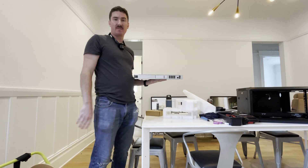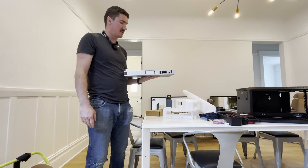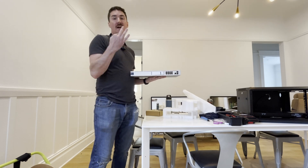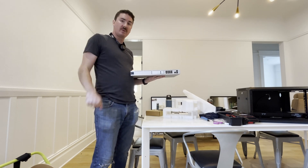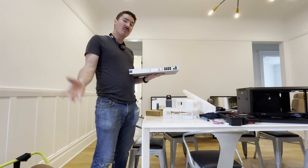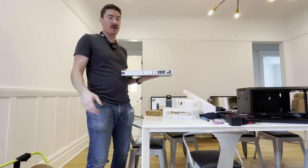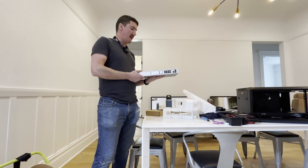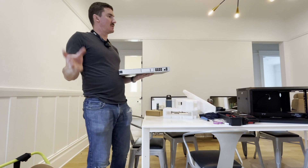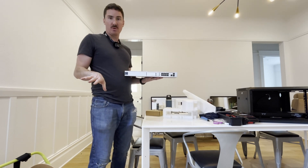The reason we ended up choosing this is a few reasons. There's a limited number of devices for this space — it's approximately 2,500 to 3,000 square feet. We have three Wi-Fi access points for the location, one security camera, and then everything else in the office is going to be Wi-Fi connected. Given budget constraints and the laptops and machines they have, that's going to work best for them.